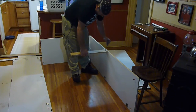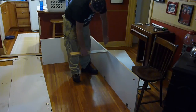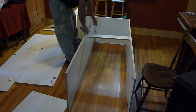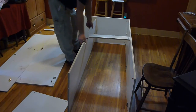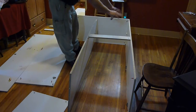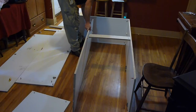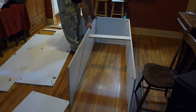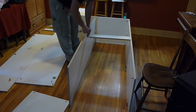And I don't like this because it tells you just to kind of hang this here and wait a while. And yet again, I made sure the arrows are facing that way on these toggle bolts. And righty-tighty. Middle piece. A couple things with the middle piece. You're going to want to make sure that the cutout piece over here is facing up. This is the back of the unit, basically, just so you know, technically. And there are two holes here that have the dowels sticking out of this piece here, that the dowels will stick up in here. And at the same time, you have this toggle nut and bolt here, arrow facing that way towards this.